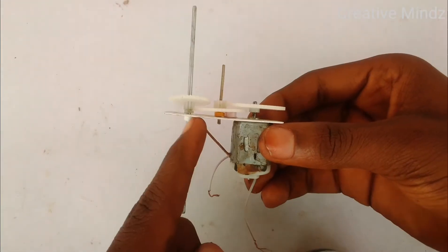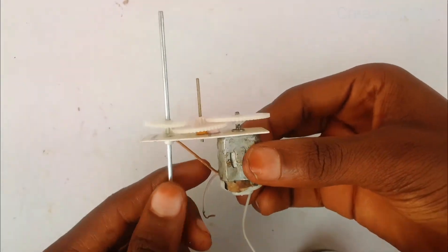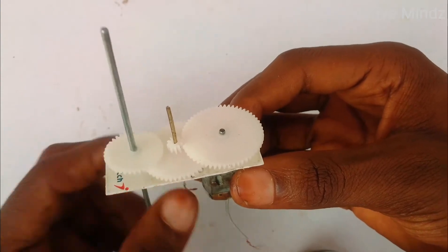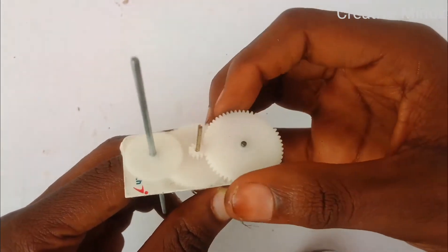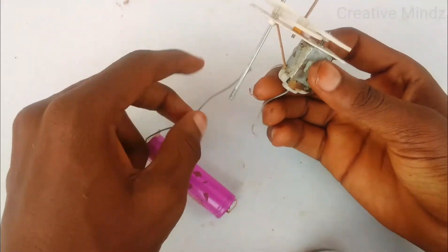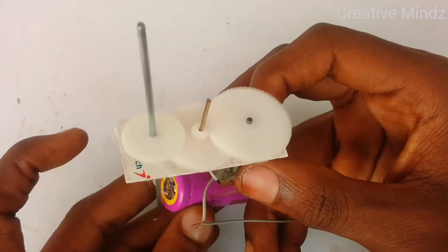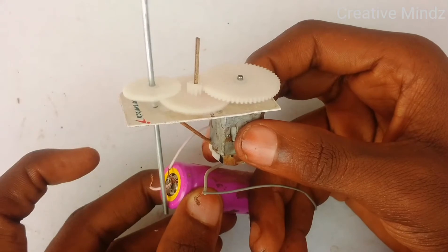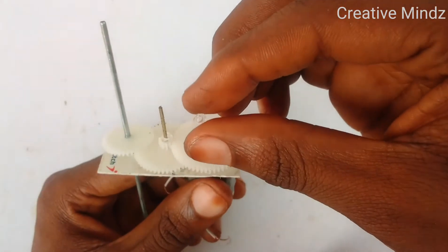Some modifications were made to keep the casing straight so it doesn't spin at an angle. You can see how fast the output shaft rotates with just a little spin given to the main shaft. Now let's test it with a power source — you can see how fast it spins. The gear ratio here is 1 to 20, which means the output shaft runs 20 times faster.